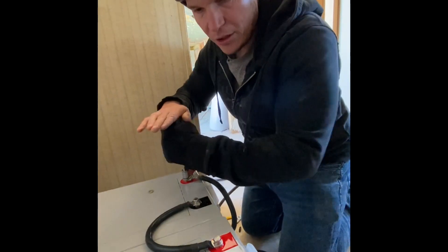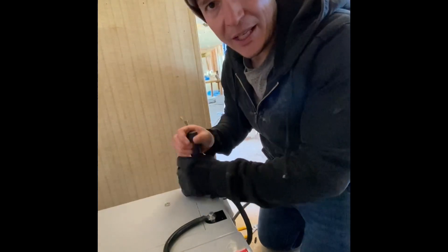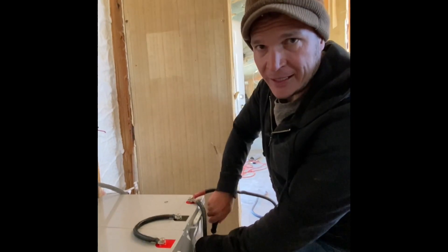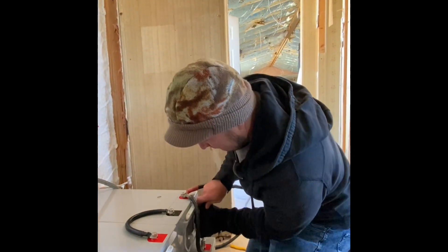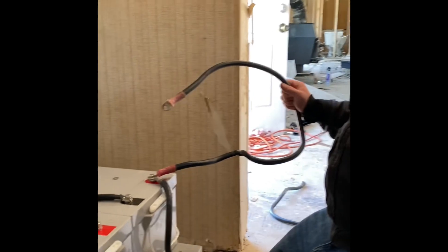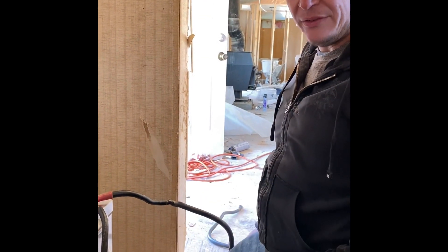You want to make sure all your battery cables are really tight. Sometimes inverters can sense when there's a loose battery cable — it really messes the voltage up. So if your inverter is throwing an error, the first thing you want to check is that all your battery cables are good and tight. All we're doing is hooking this battery bank to this battery bank, and then we have a wire that goes to our inverter.